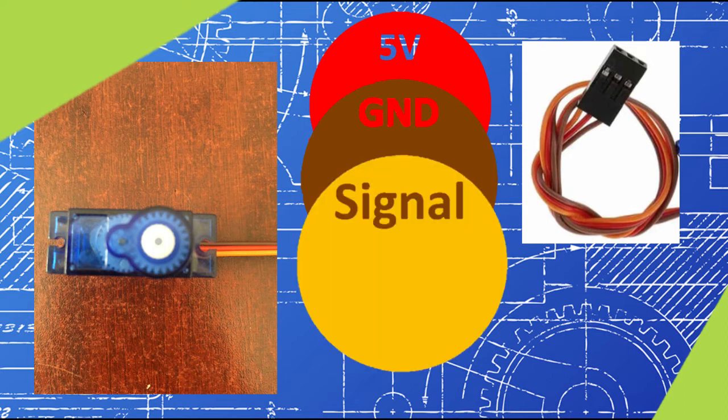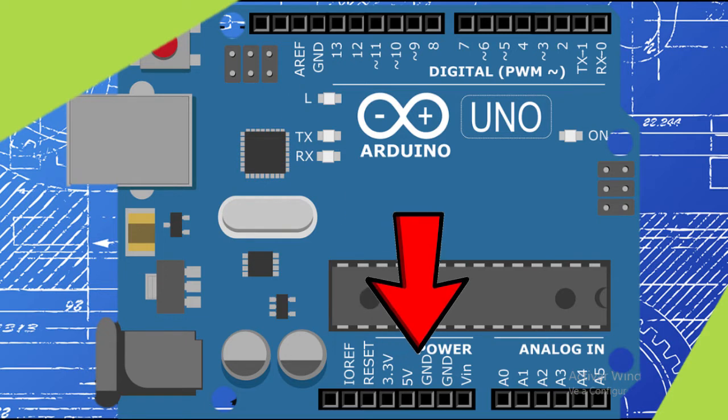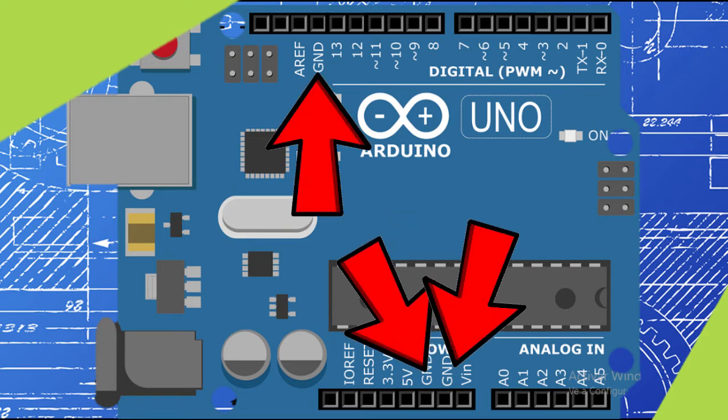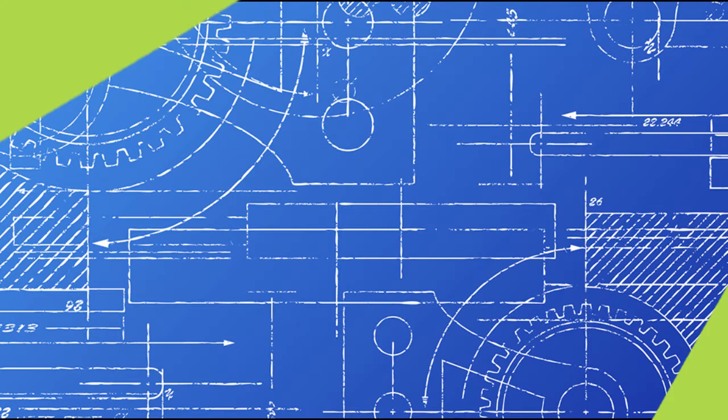5V or VCC or positive goes to our 5V pin in the Arduino. GND or ground or negative goes to our GND pin in our Arduino, and signal goes to any digital pin from 0 to 13. It is recommended that you use pins 3 to 12, and any analog pins A0, A1, A2, A3, A4, A5.